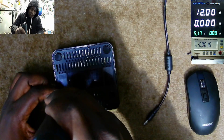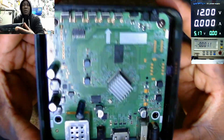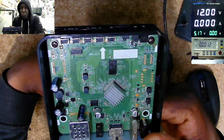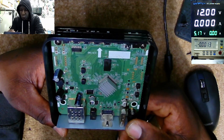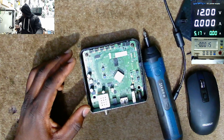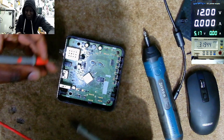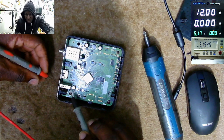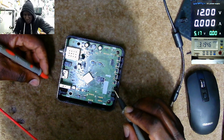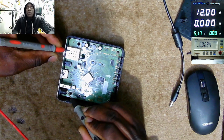Let's get inside and see, maybe we will spot something. Here we have the charging port — the 12 volts is passing through this. Here we have the gatekeeper — we have this external diode. In case anything happens, the diode goes on short. And we have so many power supplies; only the power at the charging port is short.